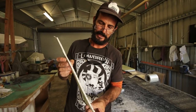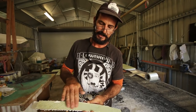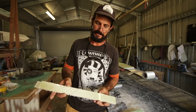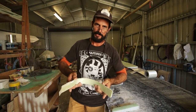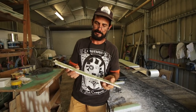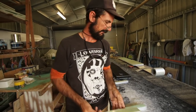David's cut some pieces up and he's using packing tape here — not really as a release agent, but as a material that releases from resin very well. This is good for flexible molds on edges. That's one of the more useful things we're learning: packing tape can be used to release resin.